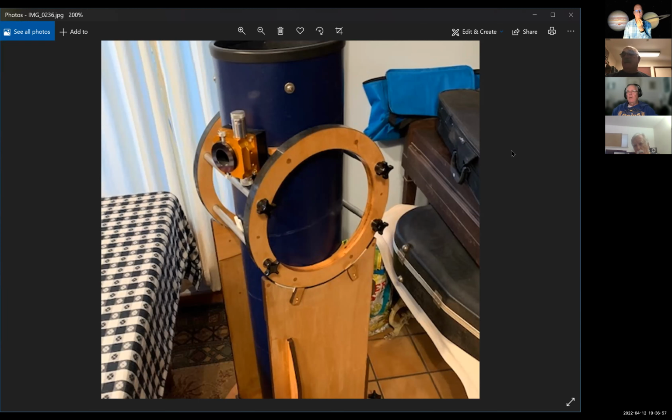That's called shear webbing. That was one of the advances for airplane manufacturers design where they didn't need any wires anymore. They had the shear webbing that gives you rigidity, the area doesn't have to be thick. And so what you might be able to do is just get some masonite and prove it to yourself, and just take off the parallel pieces of wood and just nail that on there, and you might be much happier with the way that the rigidity is.